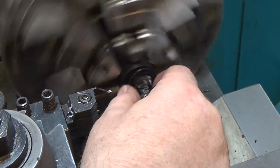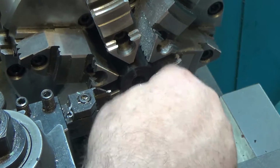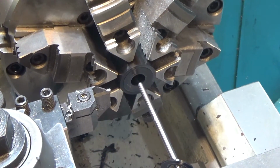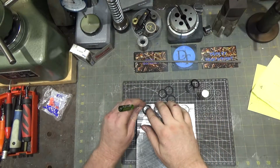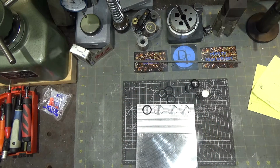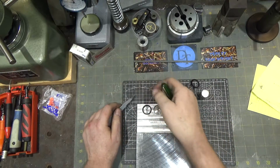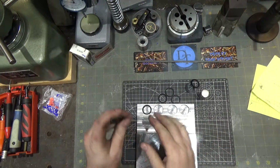Now I just need to deburr these guys. Look at that chunk of plastic that got wedged in there. Alrighty. So we made way more than we needed of these, but that'll be fine. Next up we're just going to glue these in with the spacers. And the whole point of these spacers is just to help align the magnet and keep it centered. If you're wondering how I deburred them, it's this little cheapo disposable scalpel, and I just rotated them around. Worked really well. Scalpels are really sharp. They're inexpensive.